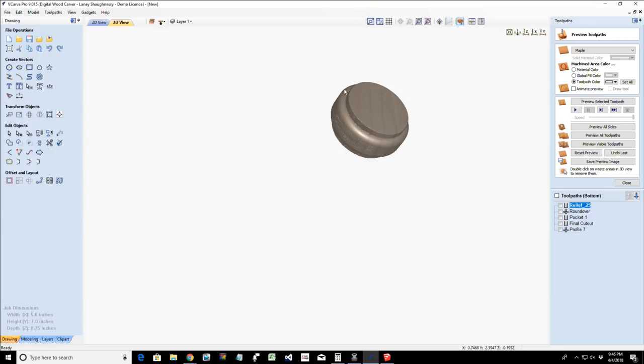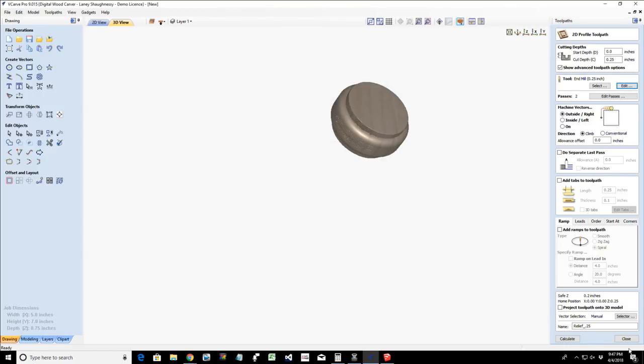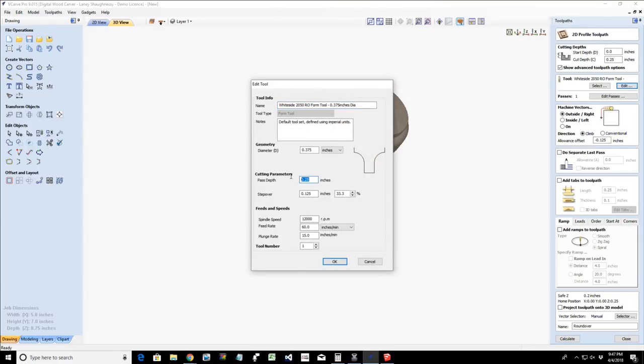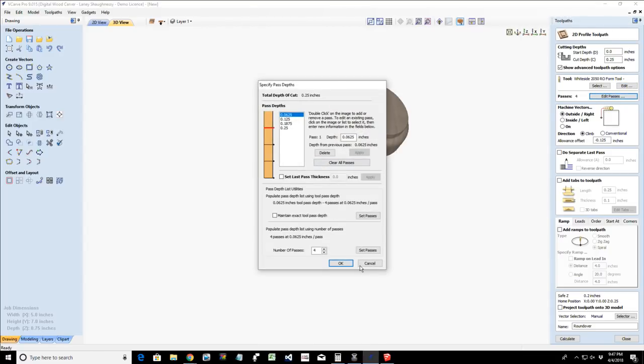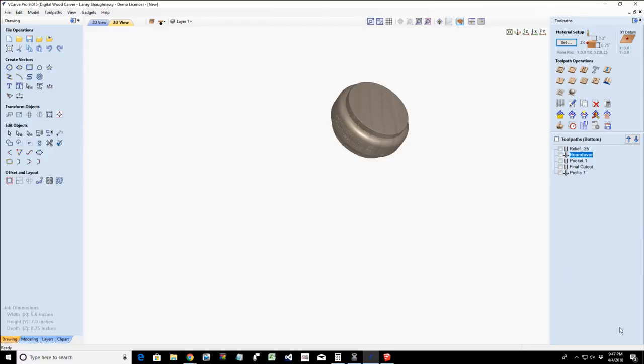That bit is a plungeable cutter. You can reduce the depth of cut for the pass depth on that bit that I have in the settings for that bit. I have it set for 1/4 inch. I can reduce the depth of cut, and that's maximizing the depth of cut. I can reduce the depth of cut or increase the number of passes that I can do. And I can take all of my passes with that without having to do the relief cut, if I didn't want to do a bit change and didn't want to do the relief cut.